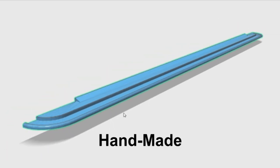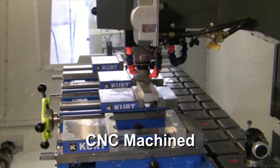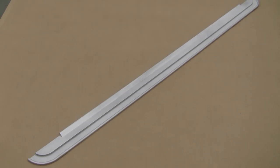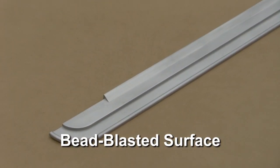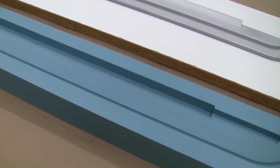A new pattern can then be handmade, 3D printed, or CNC machined, which is what was done in this case. The aluminum pattern was finished by bead blasting the surface to produce an accurate matte finish, which the silicone mold will copy and reproduce in the cast parts.